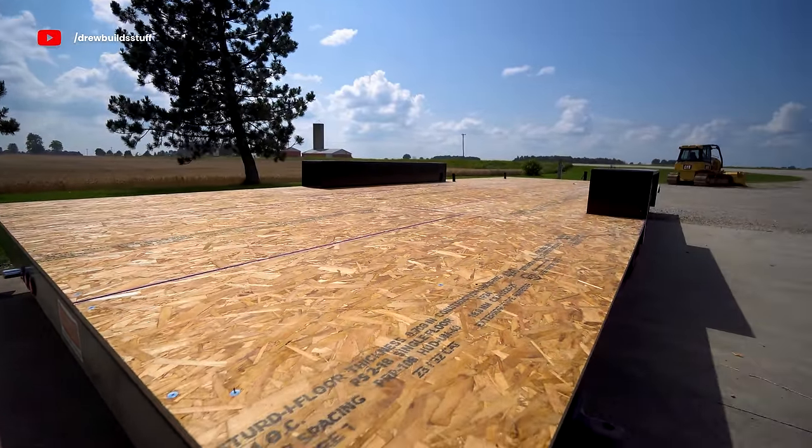So now I have these clear cedar 2x4s, and these are sitting at 1.5 inches thick. But I'm just gonna take a few passes off the backside with my planer and bring that down to 1.25 inches. This is just how far I wanted it to stick out from the wall for no real reason other than that's what I determined. Then I cut my first piece to length.